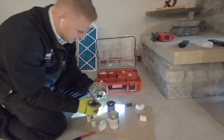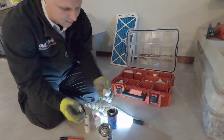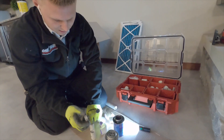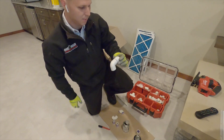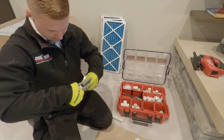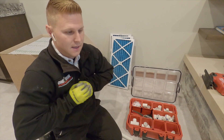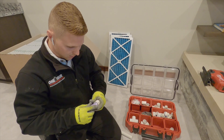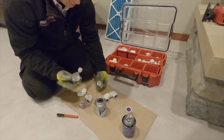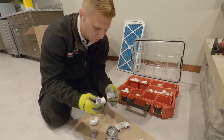I'm priming and preparing PVC so that I can rebuild this condensation drain. Making a clean surface so I have a nice good tight seal on my glue. I didn't have a PVC drain trap on my truck so I'm going to make a custom trap. If you don't get it in nice and tight with a good glued and primed surface, it's going to leak and drip water — and in this case there's plywood underneath which could rot out and ruin the floors and the closet. So it's very important to keep water off that wood. I put cardboard down so I have a clean work surface and don't get any glue or primer on the floor.